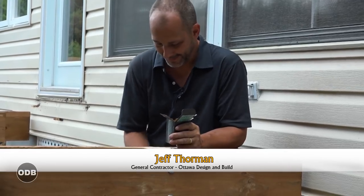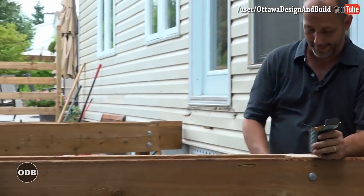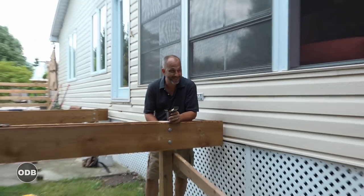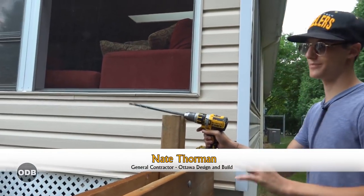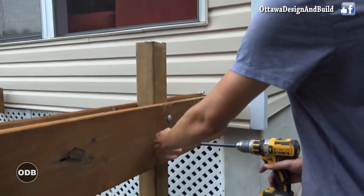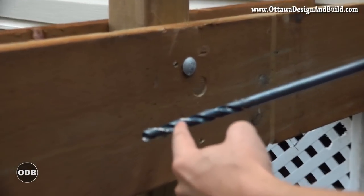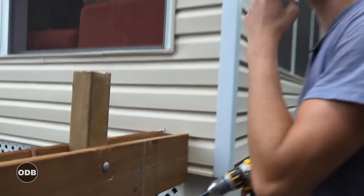We've finished drilling a bunch of these half-inch galvanized bolts in, lopping off the tops, creating a nice flat surface. My son Nate is going to give us all a lesson on how to drill a hole. The best way is to go perpendicular, and with this type of drill — because we're drilling so much — you want to go an inch into the bit, then bring it back out, then back in and out, and keep going until you're all the way through.